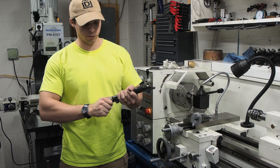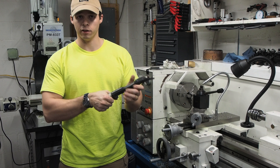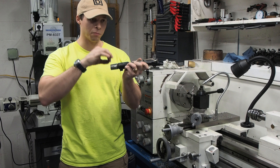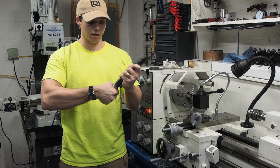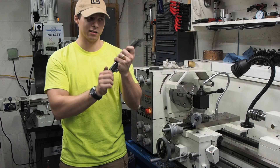Basically, a really good thread — and these are very bad threads as you can see, they're going in rough. What that is, is because they're poorly cut, there's all these bumps and ridges and they're hitting the inside and outsides of the ridges as it goes in.